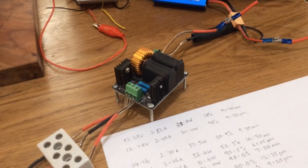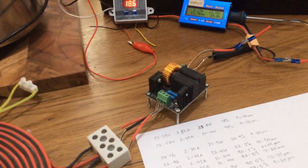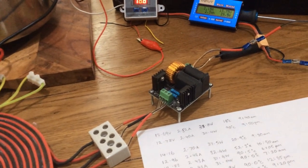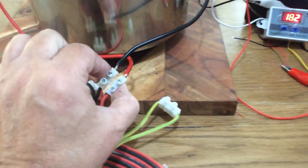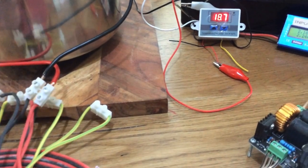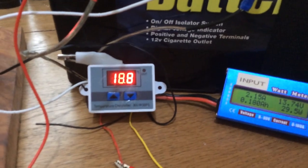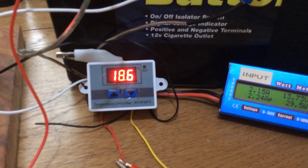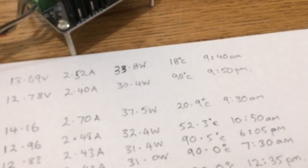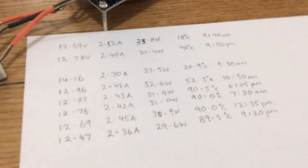It uses very little energy — around 30 watts constant — and the coil and the ZVS don't heat up. The ZVS is just a little cheap ten-dollar one, but it serves a purpose. You can actually add a homemade capacitor into this circuit, connecting it to the two element outputs — it's just a laminated capacitor that cost virtually nothing to make. The temperature is already up to 18.9 degrees.